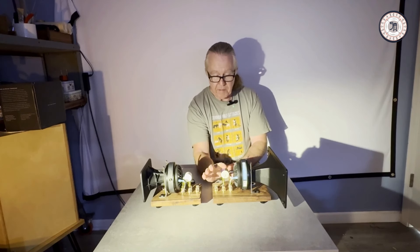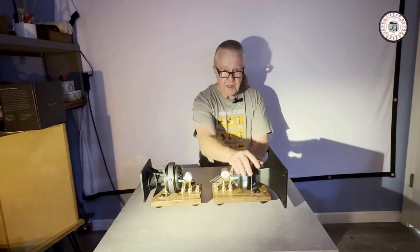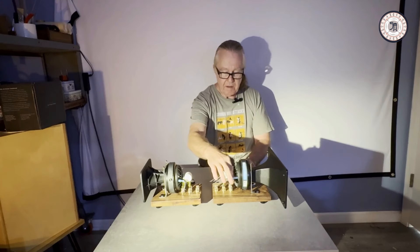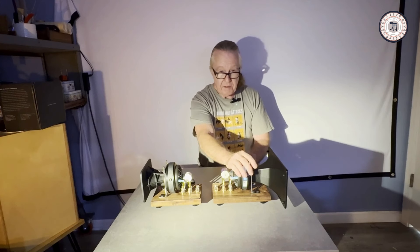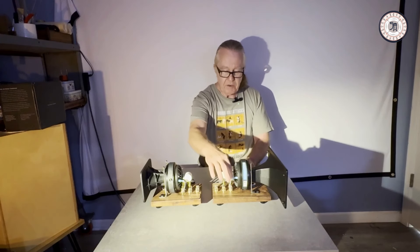The capacitor is larger — this is a 10 microfarad capacitor, and we will custom size the capacitor for you. This creates about a 2 kilohertz crossover point. Acoustically it probably starts crossing over and dropping significantly below 1 kilohertz. This driver will take that lower frequency, especially in combination with this horn, because the L-pad reduces the amount of power going to the compression driver. This will take somewhere around 100 watts or more if the L-pad is used properly.